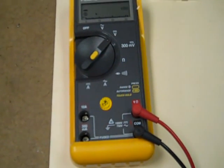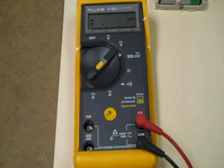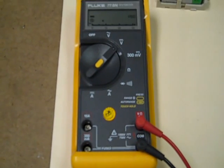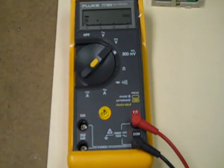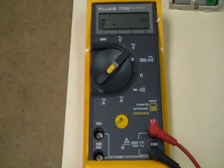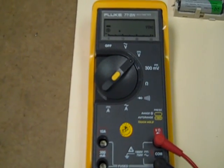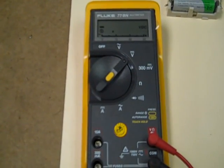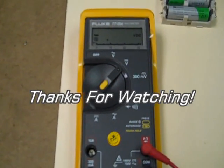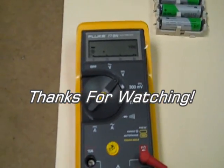A couple of other things about this: the touch-hold feature is a little slower than my Fluke 85, a little faster than the Fluke 87. It uses a 4096 hertz tone, which because I'm an old guy and I don't hear very well, I don't always hear it. And the continuity test, which also uses that same tone, is a little bit slower and less certain than the 87.